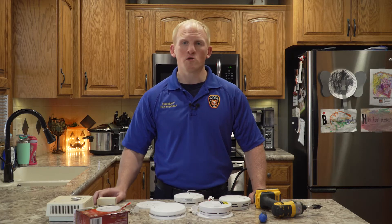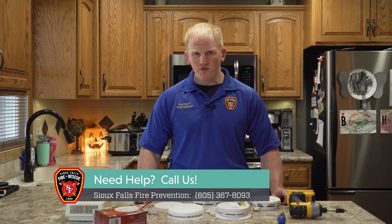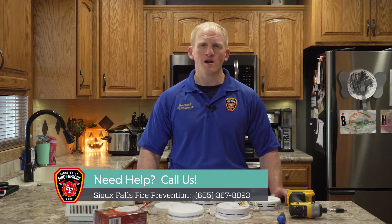Now we're going to head upstairs to show you guys how to safely install a smoke detector. That process is going to include taking the old smoke detector down and putting up the new one. A couple of things you're going to need: a ladder that is safe to climb up and down on, and of course a drill or a screwdriver. This video is geared towards those that are able to install their smoke detectors at home with proper tools and a ladder. For those of you that don't have the tools or are not able to climb a ladder, you can give Sioux Falls Fire Rescue a call at Fire Prevention and we'll come out and get you taken care of.